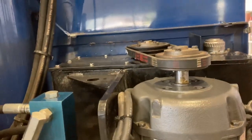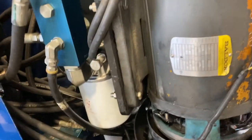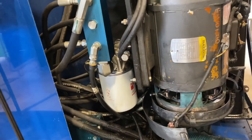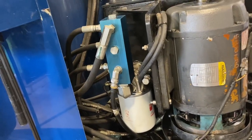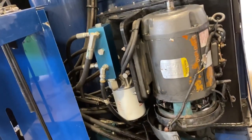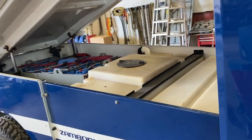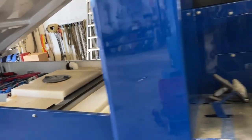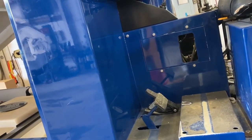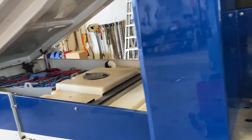Got my new belt on and it's lined up really nice. The old belt was in good shape, but that's just a preventative maintenance thing. The main thing I wanted to talk about was changing the brushes in that motor because there's a bit of a technique to it. I think I'll just make this video about doing an annual maintenance and some of the upgrades on a Zamboni ice resurfacer. These are a very durable machine and they do have the market in Canada. Pretty much everybody's running these because they're a lot better than the other brands available.